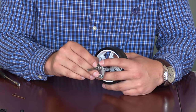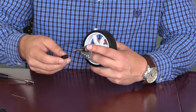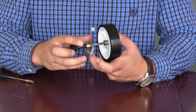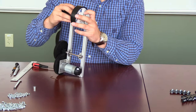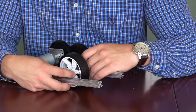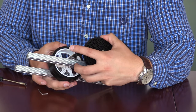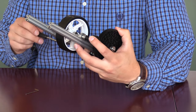Next, we will take another shaft collar and place it onto the device. Following this, we will slide on two of the 3mm spacers until flush, then attach the 15mm spacer, followed by another 3mm spacer. Then we will attach the 30 tooth gear. At this point, we can take the assembly and slide it onto the overall piece. We will pay special attention to make sure that everything is lined up correctly. Once we make sure that everything is lined up and the bearings aren't slipping, we will tighten down the final free collar. Once aligned, we will pinch the 30 tooth gear to the 125 tooth gear, making sure that everything stays parallel, then take and screw down the final pieces.